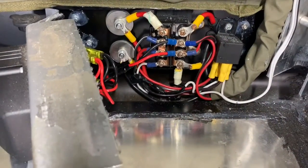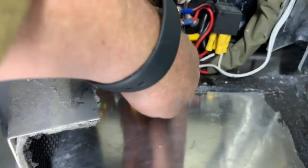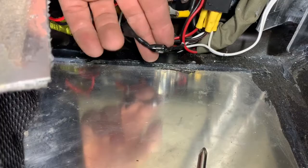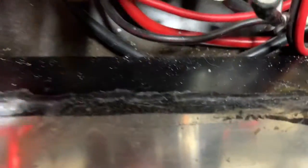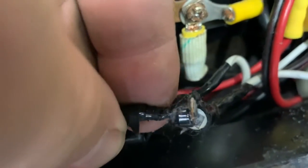When you open up the control box the diodes are wrapped in black sticky tape. There's one of them and the second one will also be there, usually on the white wires coming out. You can see that one is obviously blown — it's sort of completely fallen to pieces. So yeah, that's an obvious blown diode.